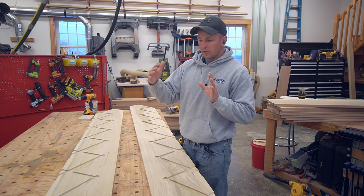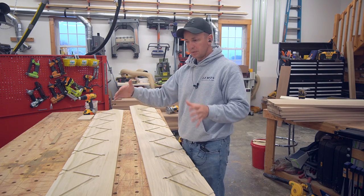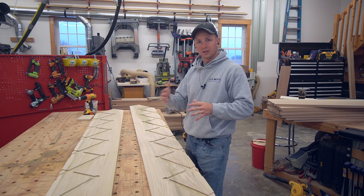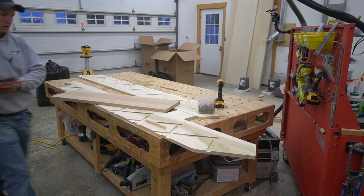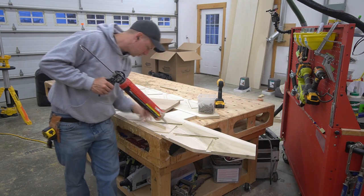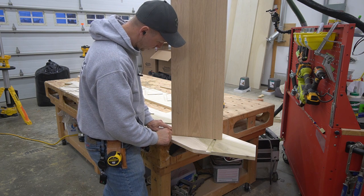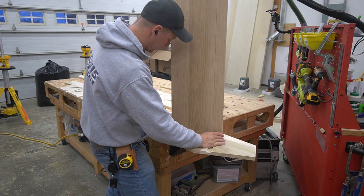And I'll also look at the whole stair as it relates to my workbench to ensure that I'm keeping it square. That's a key thing, is to keep checking to make sure that it's square and you're not creating this oblong thing. So that's the game plan. We'll see how it goes. All right, so here goes nothing. Give myself a line of PL. Now all I do is need to ensure that I'm lining up the back side with this mortise, which is going to be the front of the riser.